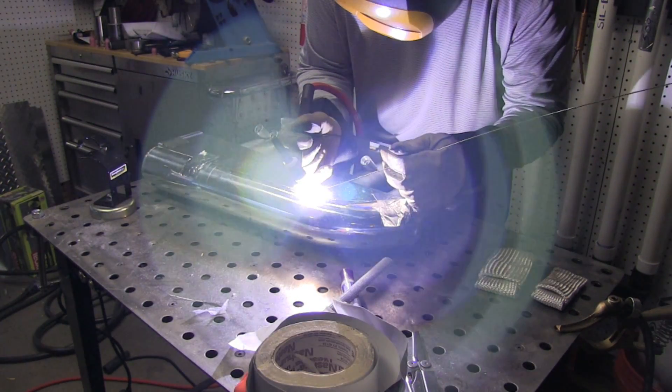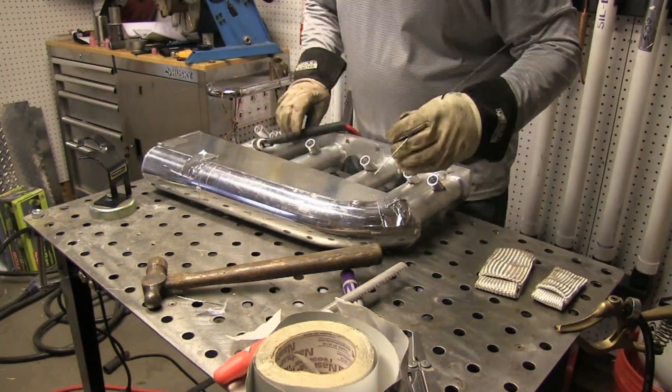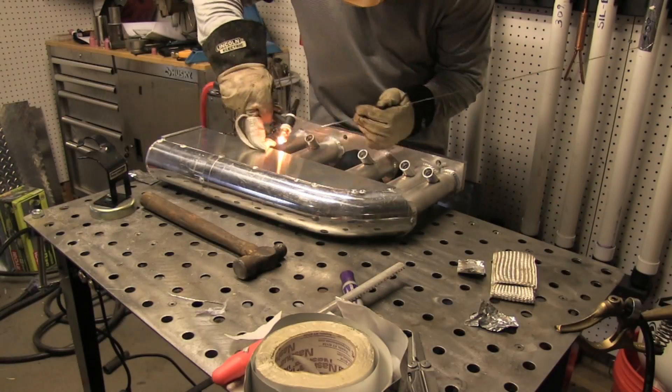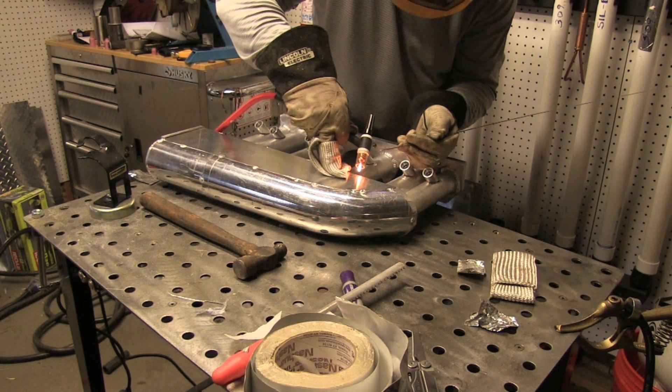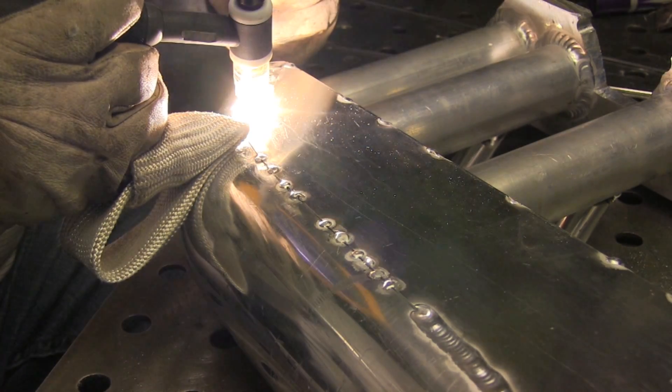I've got to get a lot of tacks, which is very common for sheet metal like this. If you don't get a lot of tacks, it will buck and you'll get mismatch as you're welding — sometimes it'll even overlap. Now here I'm welding half-inch thick to one-sixteenth-inch thick, and that poses a little bit of a problem if you're not careful. Basically it is just lighting up on the thick part, preheating it a little bit, and then stabbing the rod to join the two pieces. The thick part's on the bottom at half inch, so I just soak it with heat for a few seconds. You can see the top part wants to puddle very easily. Once I get the bottom piece to puddle a little bit, just stab a little rod in there to get the pieces to join. Once they're joined, they'll conduct heat more evenly and the thin piece won't peel back nearly as easily.